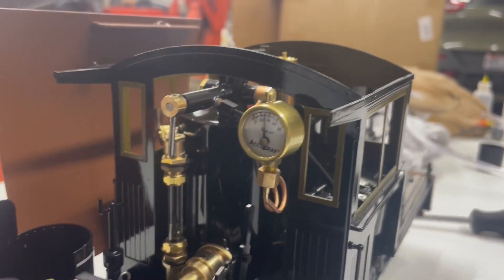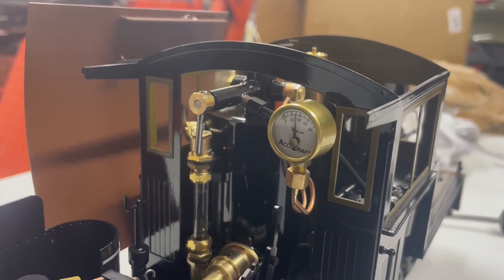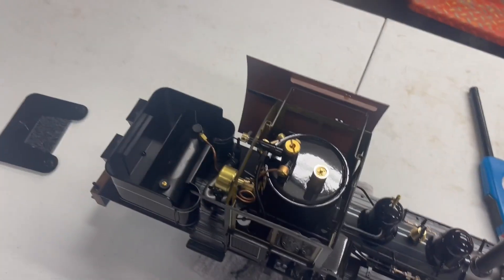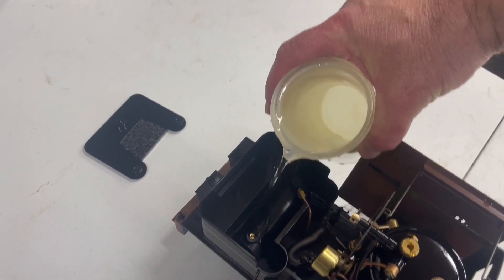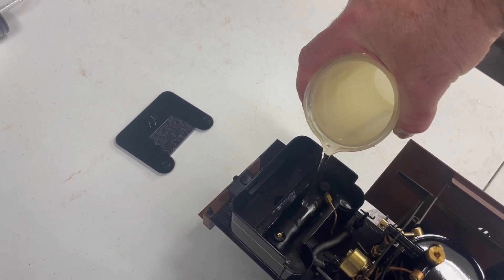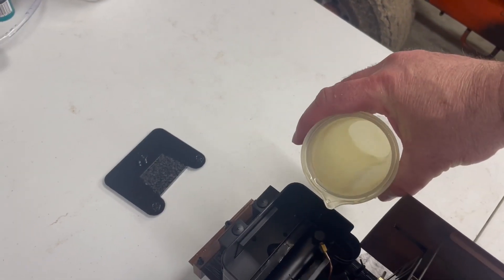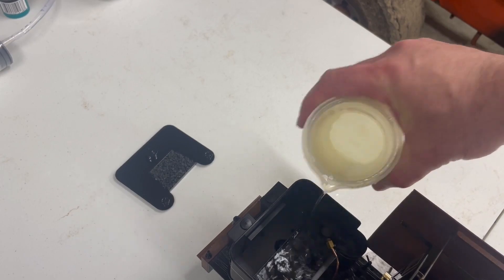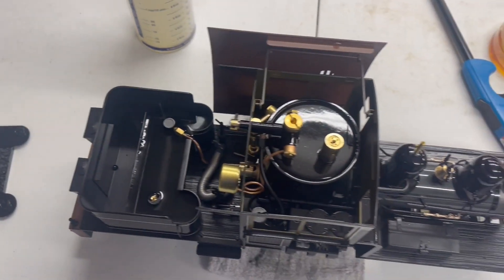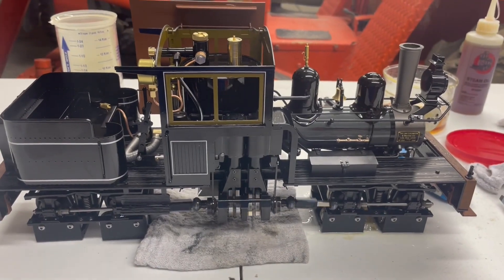I think I'm going to have to keep the butane warm. I got it open but it's not holding its steam while it's running. I did know that it helps to keep the butane tank warm with hot water, so there we go — hot water over the butane tank and hopefully it'll run better. The warm water bath over the butane is making quite a bit of difference.